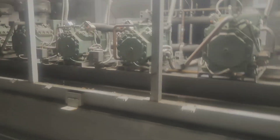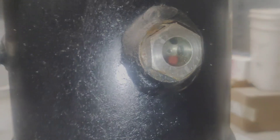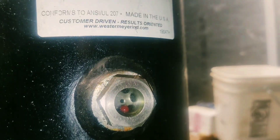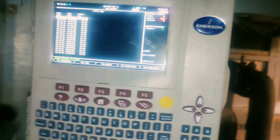I added two gallons into the suction on the low temp side. It's pumped through, gone in there, and the level came back up then went down again — ain't that crazy? But it's not blowing vapor through here like it was earlier, which was not good. Our level's actually hovering right there. I don't know if you can see the liquid bouncing around, but it's not empty like that one is. These things are cycling — they run — and you've got a whole warehouse full of food down in there.